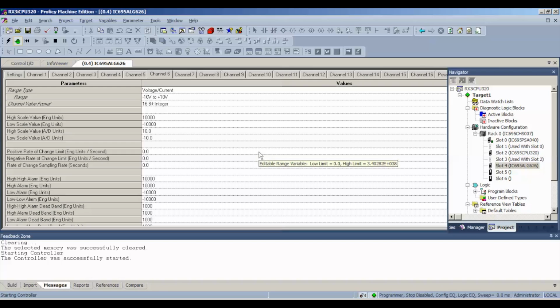Okay, so we're going to start the controller, and once you enable the outputs, your processor should be in run mode. If it's not, check to see if you have any errors in your download, or simply open your processor door and make sure that the switch is in the far right hand position, which enables the outputs. Okay, but once you're in run mode, you can follow me here.